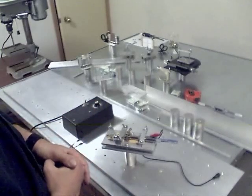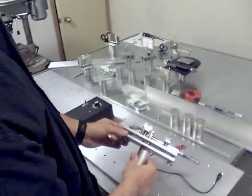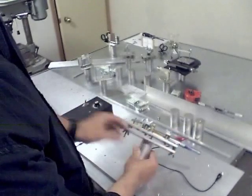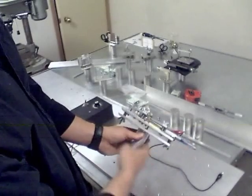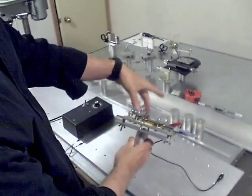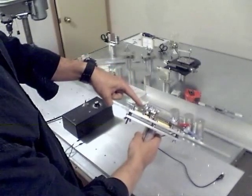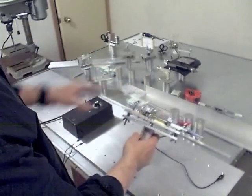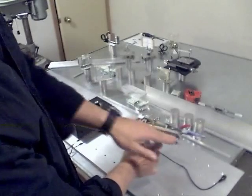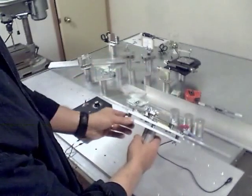This just makes it more convenient for working with interferometers. The mounting system is just a variation on the same theme — it's very similar to the beam splitter mounting system, except a little larger. We've put in a control to adjust the pan and tilt of the laser beam, various different points to pin the laser down, and we've also put in a polarizing beam splitter at the end, which allows us to select out different components of the beam. It's just some straight slabs of metal cut to size, screw holes put in, springs added, and then put all together.